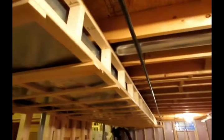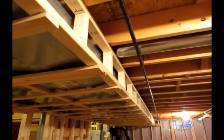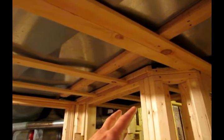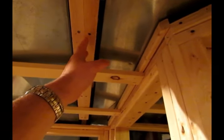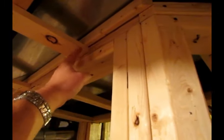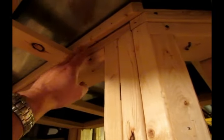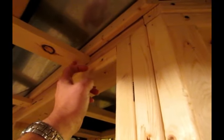At the end of the day, we've got a nice straight almost 25-foot run of ladder here, and we're going to have ourselves a nice straight smooth ceiling. At this end of our drop down, I ended up having to be a little short because I'm running up against this closet wall. I have a ladder here, a ladder coming in the center between these two duct trunks. Over here it would have been a little difficult to tie in this thin one-by-three just butting it up into this header plate. So I took another small one-by piece, put it across, and it gave me a little more material to nail up through into this piece, and it came out nice and tight.